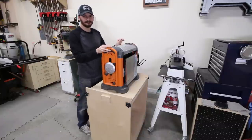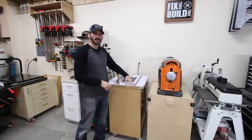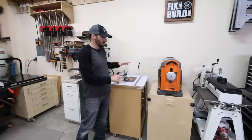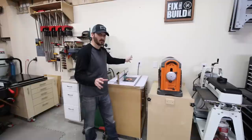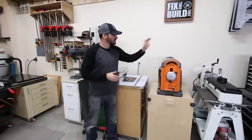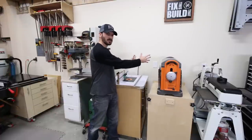The workflow has changed a bit. I still have my router table here, though I want to change out the dished phenolic top. For power along this wall, I have alternating 110 circuits so I won't overload a single circuit. I also have a blank plate here for a 220-volt circuit — I don't have any 220 tools in this spot right now, but if I did I could just swap in a plug.